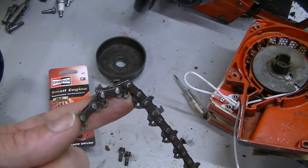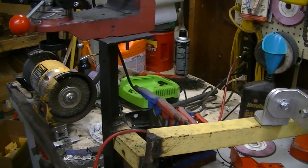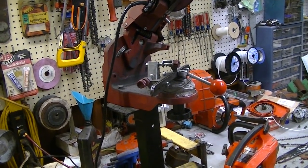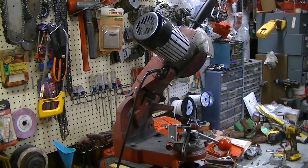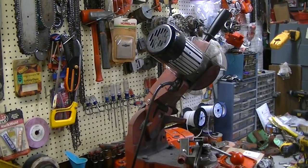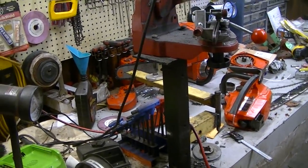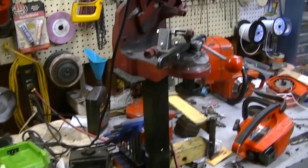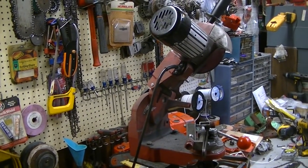Nice sharp teeth. That's why I prefer to grind like that. This video has taken way longer than the actual job — I'm seeing 14 minutes on this video, which is utterly ridiculous. The actual time to take the chain off that little Super 2 and grind it is 5 minutes at tops. It's not for everybody, but if you do a lot of cutting in wood that has dirt, rocks, oak, or logs that have been skidded, it might be worth the investment. You can get them for around $150 on eBay. I built the stand myself and added a chainsaw mount for working. Anyway folks, that's a little narrative of why I like to use a chain grinder. Thank you.